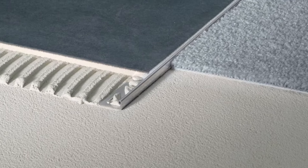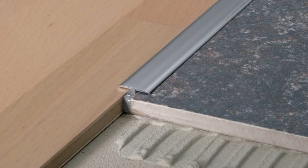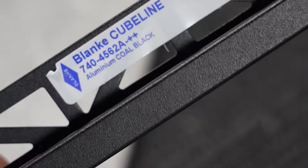The simple benefit of metal edge trims is to terminate the edges of your tile. When your tile is finished and you're transitioning to another finish like drywall, wood, or a cabinet, you want to end that with a finished piece — often a metal trim, maybe a simple L-angle or even a cube shape to add an aesthetic flare to your installation.